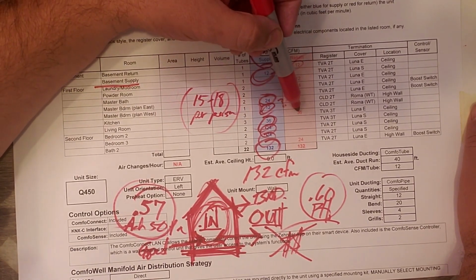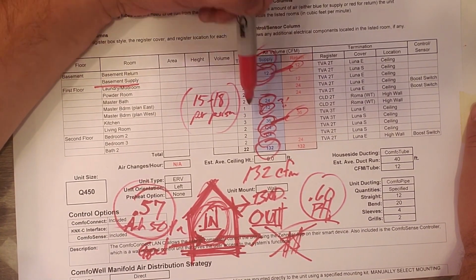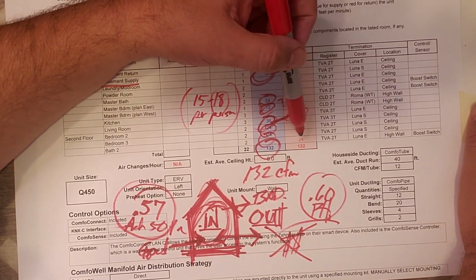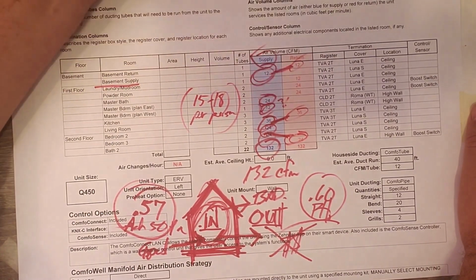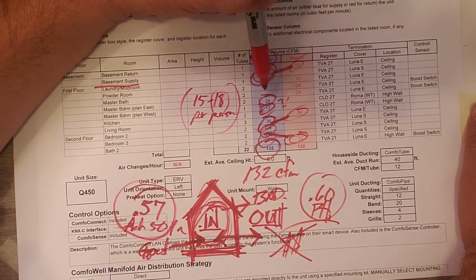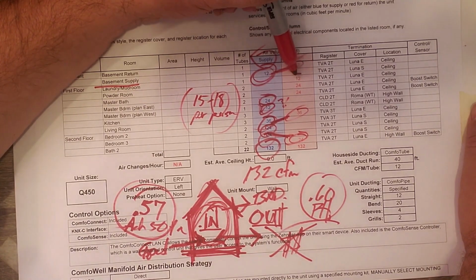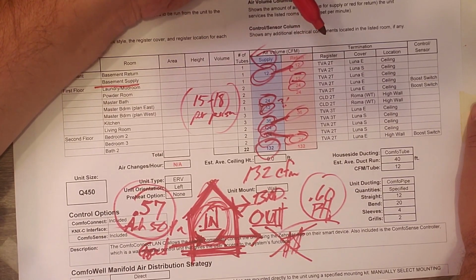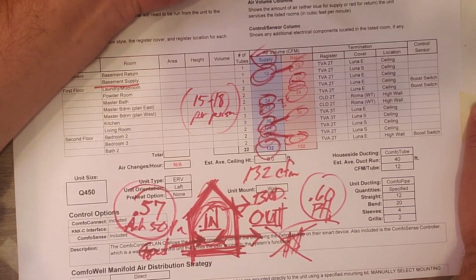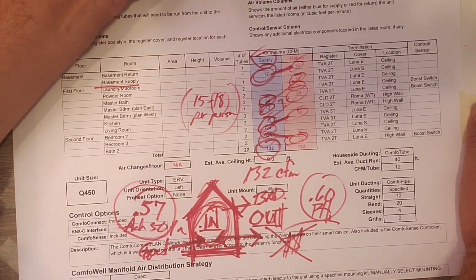You can see in the kitchen, we're doing a dump of 36 CFM, which is a direct relationship to the living room. Upstairs, we're taking out and exhausting 20 CFM, which is a direct exchange for one of the bedrooms. And then downstairs, when we were in the bathroom, we talked about laundry mudroom, exhausting 12, the powder room, exhausting 24, and then the master bath, exhausting 24 there, right? And so those balance out that other 36 and that 36 there.